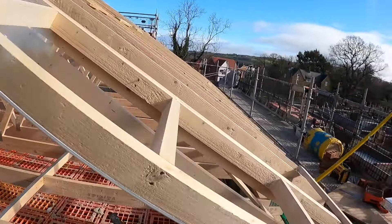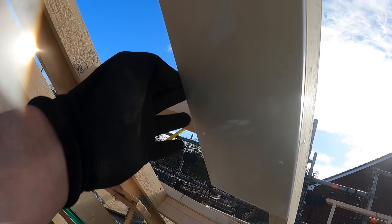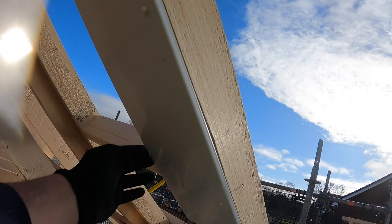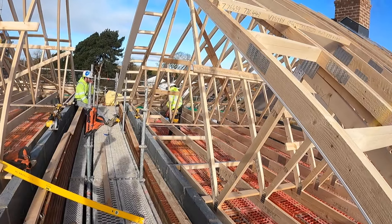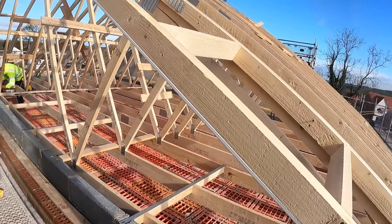To get this plumbed up, all we've got to do is level off the brickwork to the back of the soffit. Then the brick layers will fly through and just run up past that, and they'll also trap in the ladder as they go. We'll get that leveled up now — start at the two bottoms and then work our way up, making sure they're all sweeping, then nail up all the bracings that we left on that first truss so it's strong.